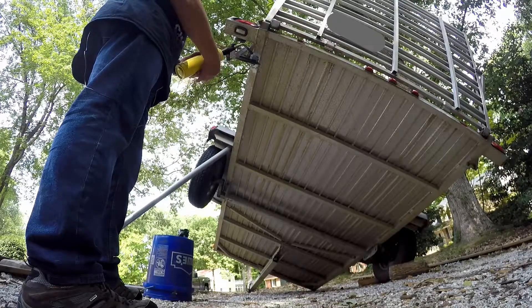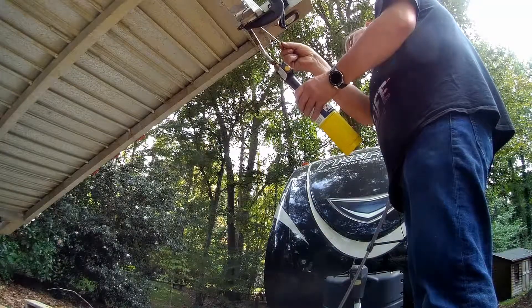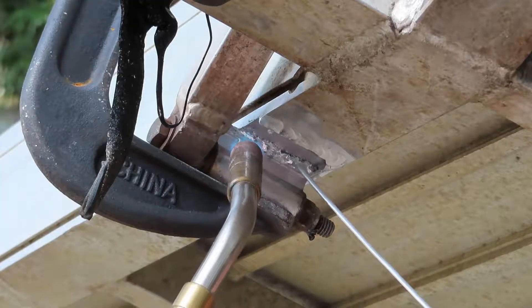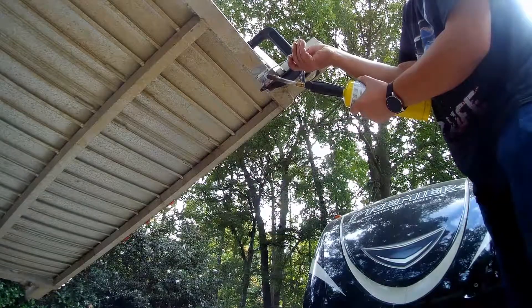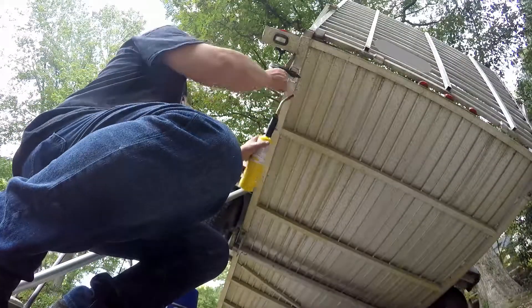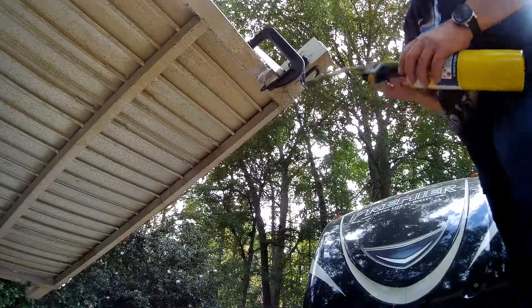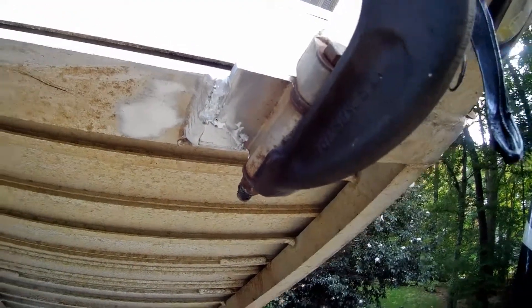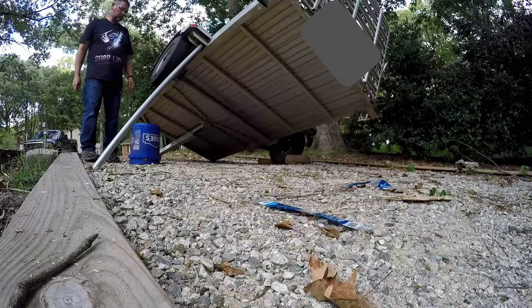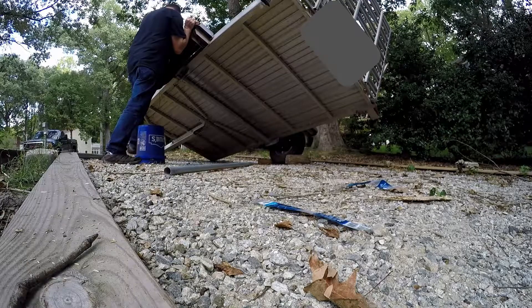This part of the repair was the hardest part. As you can see, the metal here is a lot thicker than it was on the tailgate, and also that big steel clamp I used — the only thing I had that was big enough to clamp it — sucked a lot of the heat out as I was trying to work. It made it pretty difficult. I think the tailgate repair is going to be okay; it seemed to take the brazing pretty well. But the part on the bottom where I put the rod back on, I just couldn't get it as hot as I wanted to. So what I ended up doing — I don't show it on the video — is I drilled it out through the biggest part and put a 3/8 bolt through there and tightened it down, just to be sure that it couldn't break off again, at least not where I welded it.